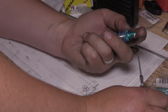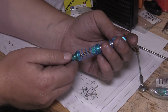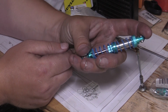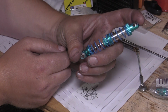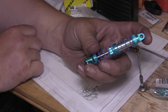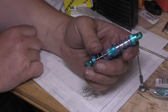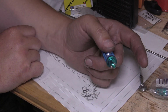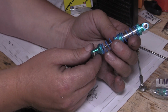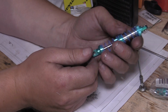I did think about making the shock absorbers, and I was speaking to somebody who had made their own shock absorbers for their RC car, but they said it was a lot of work, and so I decided just to buy them. So these were the best fit. I think I might have to make some little adapters or modify the wishbones ever so slightly. Particularly on the front. For example, on the front wishbones there's a 6mm wide slot for this part of the wishbone to sit into. I think I need to open that out to 8mm to allow that to go in, but that's all we're really talking about modifying.